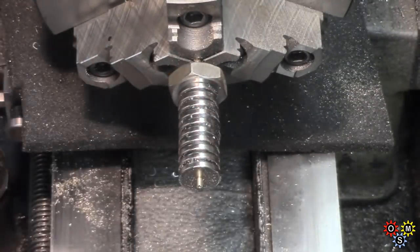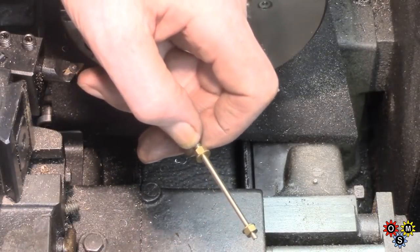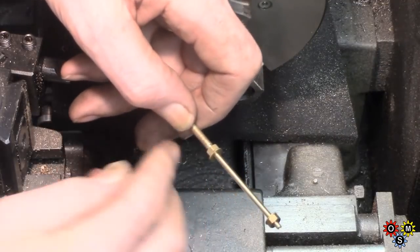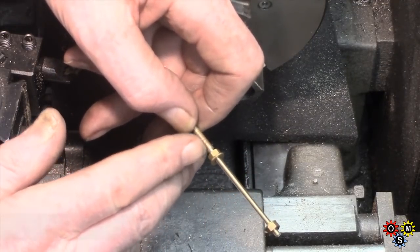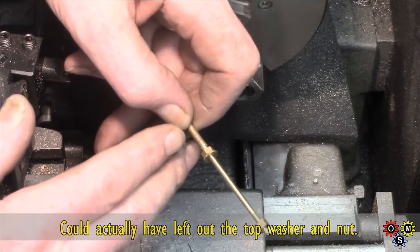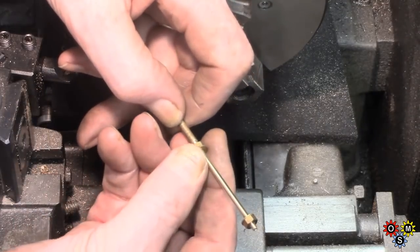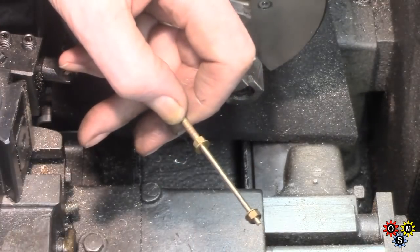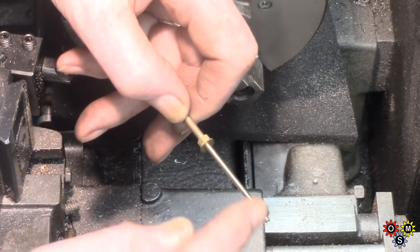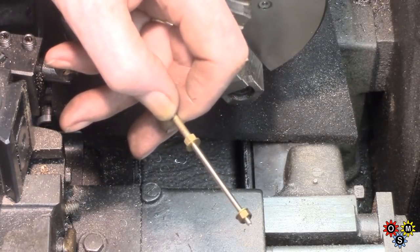Oh, that takes some coming off. Well, this is a bit of a fake up, or will be. I found some brass 6BA nuts and I could only just get a bit of 3mm thread on them. It's not ideal, so what we'll have to do is Loctite down here, and then the magnet block, and then Loctite this end and trim it off, and hopefully that'll do the job.